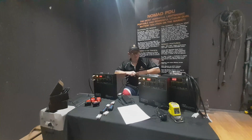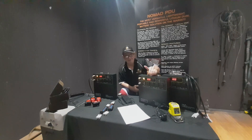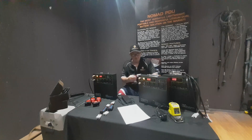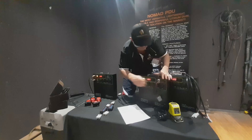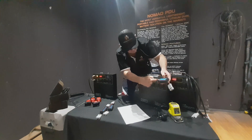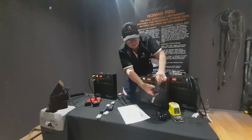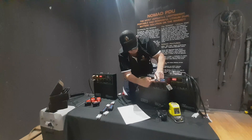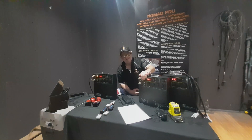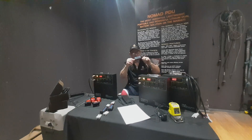Now what else could happen — say the unit was not charging fully, but the charger is showing 12.6 volts coming out. The other thing it could be is a calibration issue with the LED screen. That does not mean the unit has an issue at the battery level or the BMS level. You can use the diagnostic tool to plug into the output and check what current is coming from the source — if what's coming out is 11.5 and the screen shows 11.4 or 11.5, they match. Very rarely, if the analyzer showed 12.6 at the output but the screen said 11.5, then you'd know the voltage monitor screen is not calibrated and needs to be replaced. We've only seen a couple of those out of 2,000 to 3,000 units.